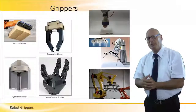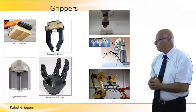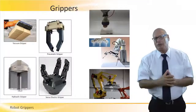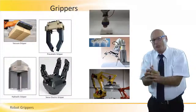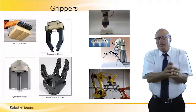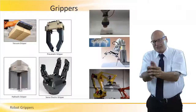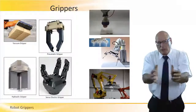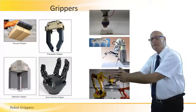Pick them and place them at point two. We have a hydraulic gripper where, by having tremendous oil pressure, the grippers actually close on the load — closing on the body to be moved. And as long as there is oil pressure, these grips will be closed. So: going to pick, closing, going to place, placing.